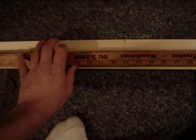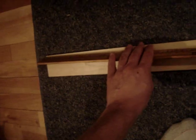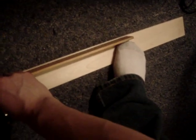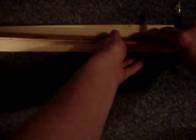So now we're ready to draw out the back half of the curve. And just to kind of show you what we're going to do, you need your straight edge. And I just take it right down to the floor, right? And then I'm actually going to line up the straight edge with the edge of your work. And I actually just put my feet right at the end there. And then I just draw back like a bow until you get to this 1 inch mark that you've drawn. You may need to adjust your toes a little bit, and then you just draw out the curve.